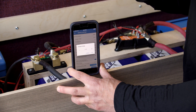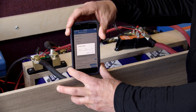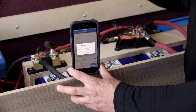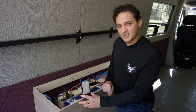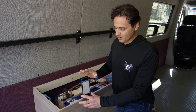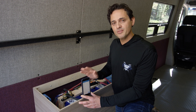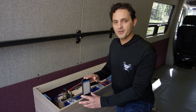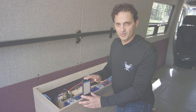If you're not quite getting to 14.4 volts, feel free to drop this down to maybe 14.2 volts. That will ensure that when you're very close to full, it'll trigger the device to recalibrate to 100%. Finally, there's the tail current. The tail current of 4% of the maximum current is the default setting and you can leave it there. If you have any other questions on wiring or programming the BMV series battery monitor, please feel free to call in at Battle Born Batteries and we'll be very happy to help.